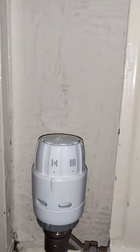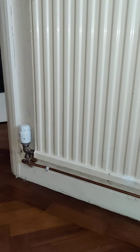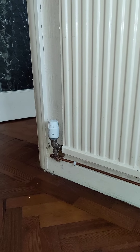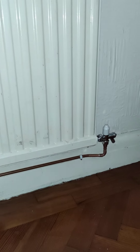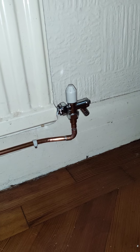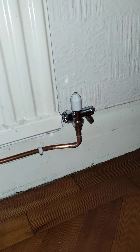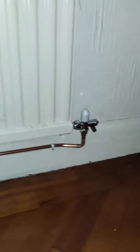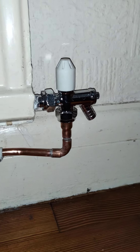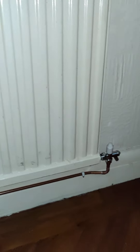The radiators have been fitted with these dynamic radiator valves and a lockshield valve. We can turn the thermostat side but we never turn the balancing valve, because this will upset the balance of the radiators and affect how the house heats up — it's only used by the plumber to balance the radiators. On this particular radiator in the hallway we've got a drain-off point, so it's a nice easy point to drain the heating system.